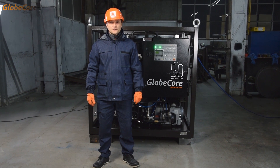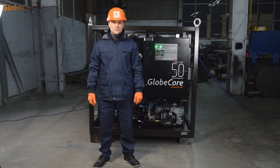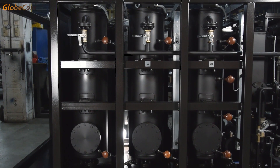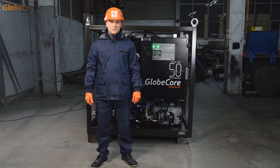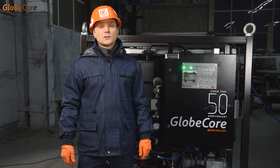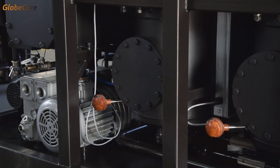Let's first talk about the area of application for this plant. The original idea was to regenerate transformer oil by adsorption with Fuller's Earth. The actual machine has six regeneration columns with 75 kg of Fuller's Earth in each column. The machine is also capable of reactivating saturated sorbent. This process occurs at around 600 degrees centigrade by burning. The sorbent is reactivated directly in the columns. Therefore, the machine is a complete oil regeneration solution with semi-automatic controls.